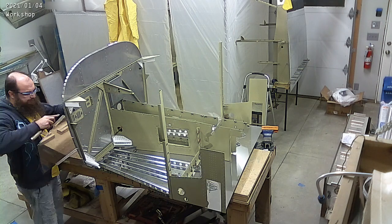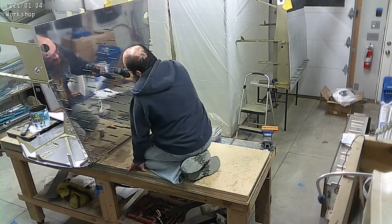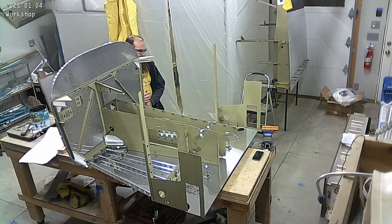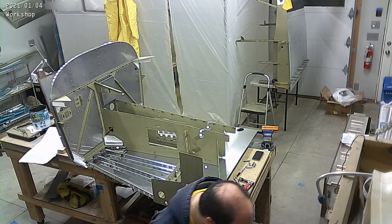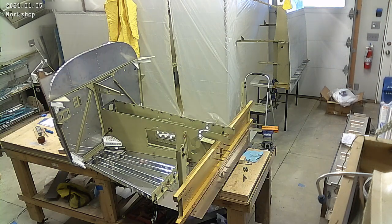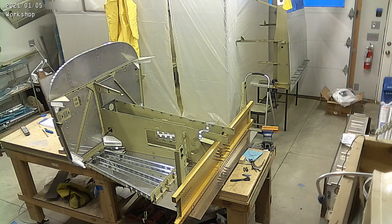This is starting to look like an airplane part. You see that sort of sub-bulkhead right there in the middle. We had to drill the firewall tunnel ribs, which is why it's tipped up, and then we tip it back down and get everything else drilled and in place. Disassemble, deburr, reassemble, disassemble, deburr, reassemble. And the wing spar carry-through is attached to there, because this actually mates to the rear. You see there's a spar carry-through on the part on the table in the back, so those two sort of mate together.